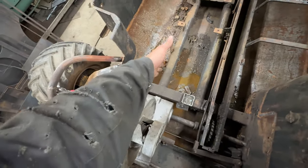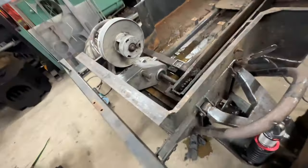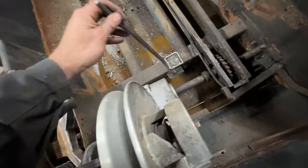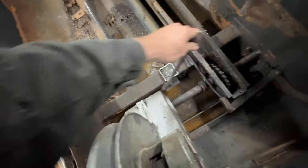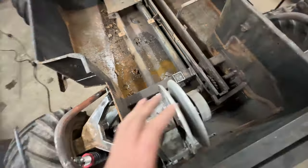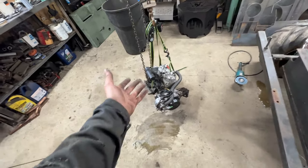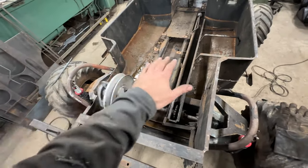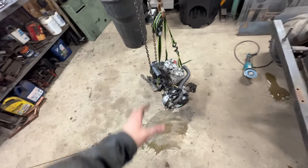I want to say deflection, but we're not going to worry about that too much right now. I was really nervous the keyway was going to get stuck, since that's essentially how you drive the drive axle — but as you can see, it's pretty lively and moving freely. That's going to allow me to shift this gearbox back and forth pretty easily. We have our 600 suspended right now so I can rig it up center, pull the tub back, set it in place, and see where it needs to go to make a template for motor mounts.